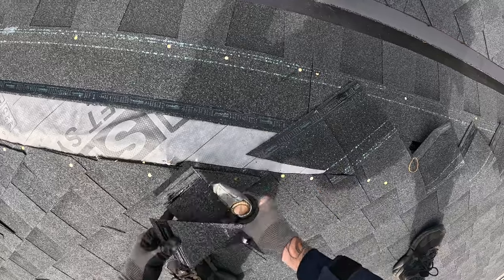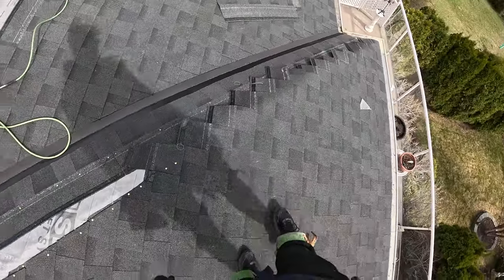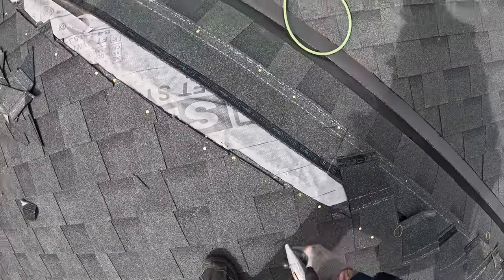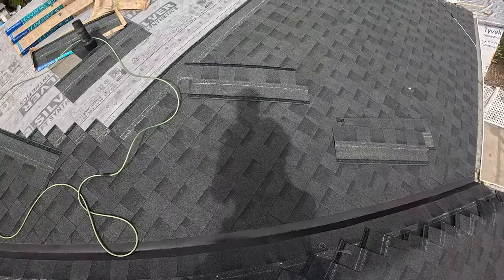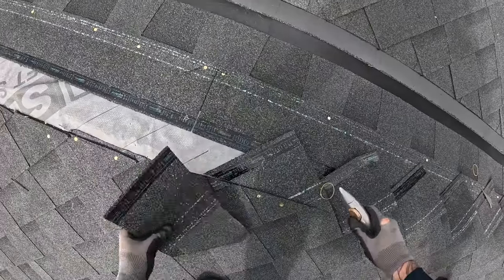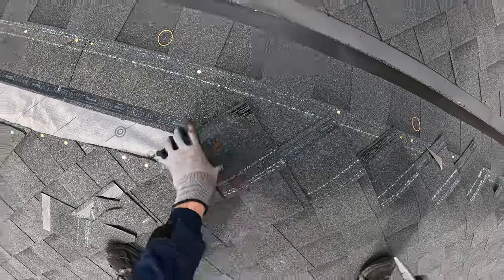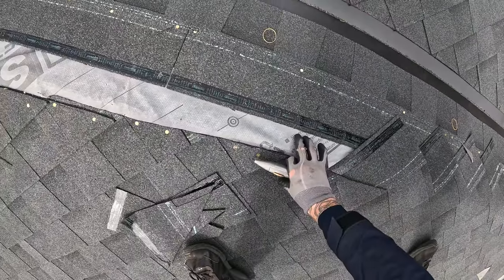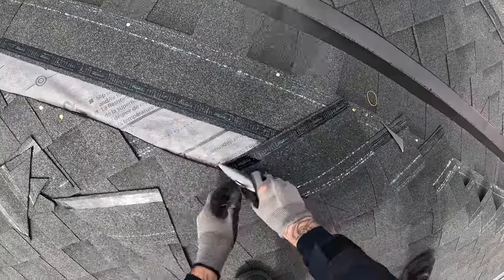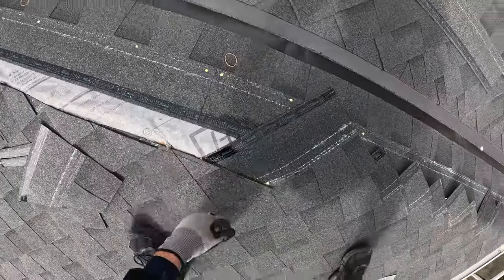Some of you are probably wondering why I do these double nails. In Canada or northern states when it gets cold and you're trying to cut these, it's gonna want to rip. When you're cutting and it catches the shingle, it pulls your shingle up — pisses me off. So I just started double nailing them all. I try not to do it in the summer because sometimes your nails get in your way, especially since we use short cap — not the really wide stuff — so you have to keep everything really tight. You can catch your blade on them and that makes things super annoying.